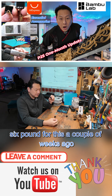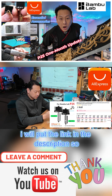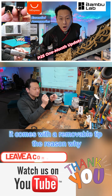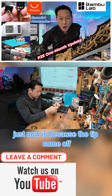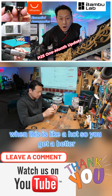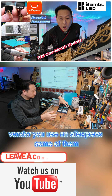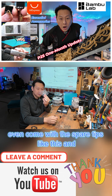I paid £6 for this a couple of weeks ago, and now I think you can get it even cheaper. I'll put the link in the description so you guys can have a look. It comes with a removable tip — the reason you can see the metal bits is because the tip comes off, so when it's worn out or stuck you can actually change it. They do say to change it when it's hot for a better seal. Depending on which vendor you use on AliExpress, some of them even come with spare tips.